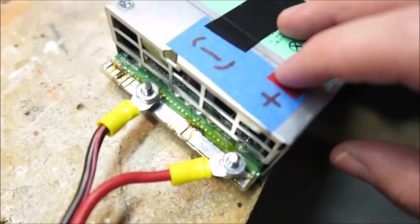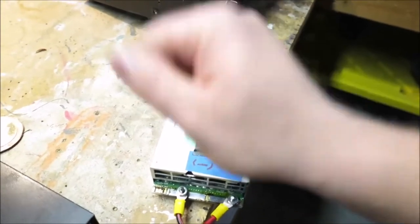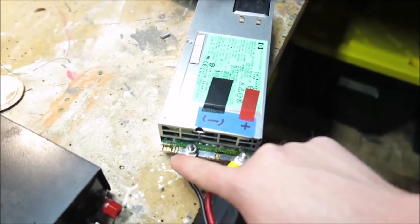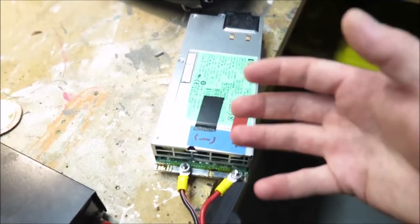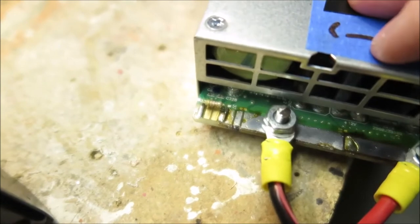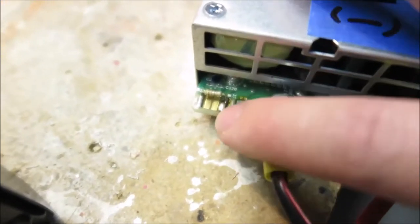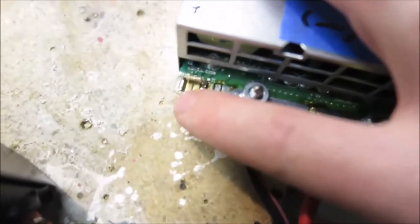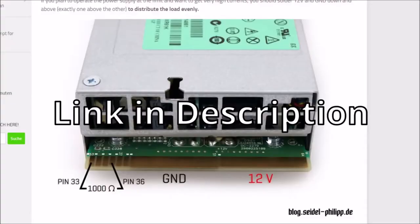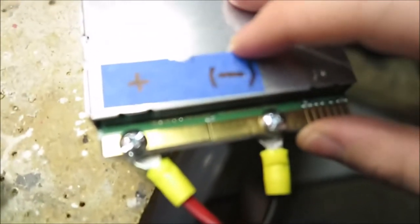There is a slight issue: the output of this power supply isn't standard binding posts — it's PCB traces. When you buy this and plug it in, it won't output 12 volts. Like other PC power supplies, you have to trick it by soldering a small resistor — I used a 470 ohm resistor, though anything between 300 ohms and 1 kilohm should work — between solder pads 33, 34, 35, and 36. I'll link to a guide. To get power leads on the PCB traces, I drilled holes for some machine screws and tightened them down.